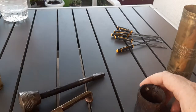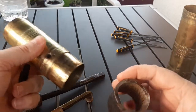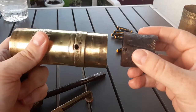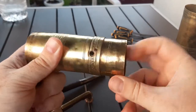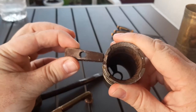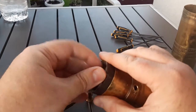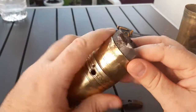Okay, there's another nice little element here. Well, I'll put it together firstly. So this goes in here, and you can see the elements. Let's put this together. So you can see the fixing holes are meant to line up there. So let's get this in. That's about right, okay. Actually, let's pull it out a little. There's a nice little design feature here. See this element here, this has got to fix in as a locking tang. You can see that it's not uniform in width, and that's because if you just slide it in there, it slides very neatly from one side to the other, engages in its grooved rails, and you can't get it out, but it's easy to disassemble if you need to. We can't get it out under normal operation.